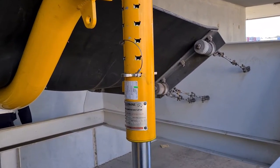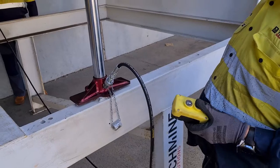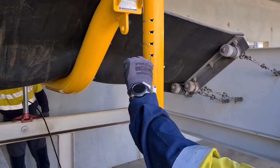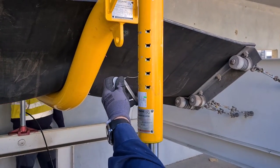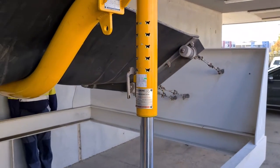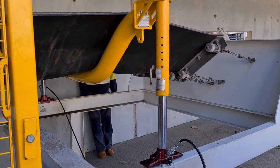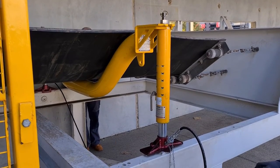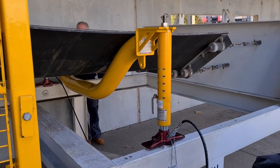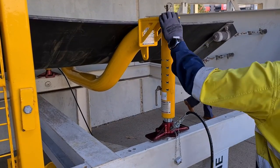To be able to remove the locking pins, we obviously need to go back up on the hydraulics, so we'll come back up. Communication line happening. Energising. Locking pin can now come out safely. Pin out, pin out — put it back in its securing spot. This allows us now to lower the hydraulic lifter back to the ground. Coming down. Done. Perfect.